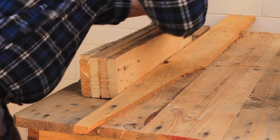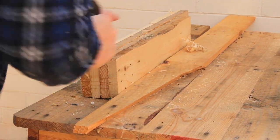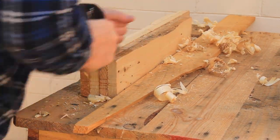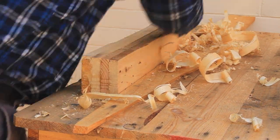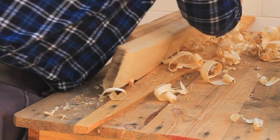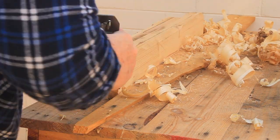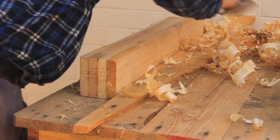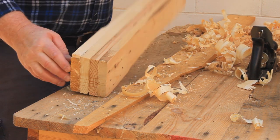Put the legs on your planing bench and plane the edges smooth and flat. This can take a while if the boards weren't very close together in width. The chamfered edges are on the outsides of the legs.